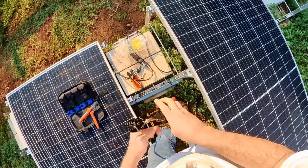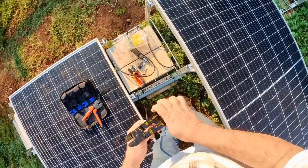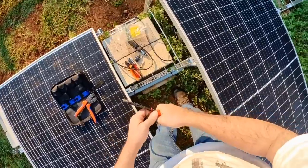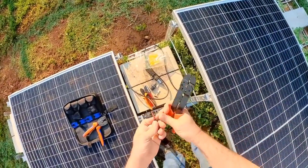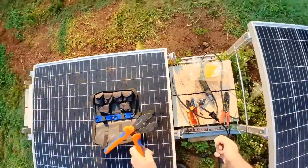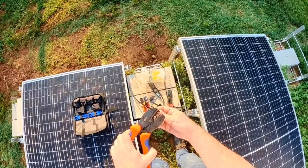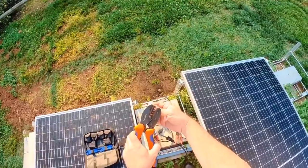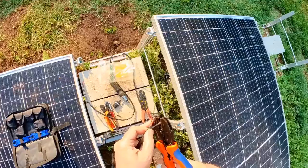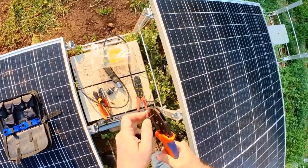If you don't get a nice straight connection, it's hard to put together. About three-eighths of an inch. These are our crimps and this is our crimper — you want to use the middle hole. Just get it started like that, then make sure the wire goes all the way into the insulation and hits the metal. Crimp it good and tight.